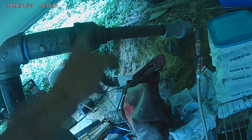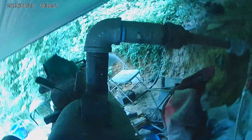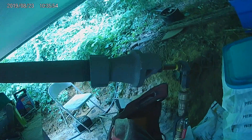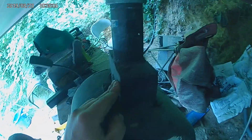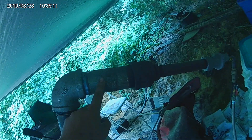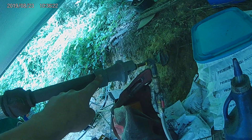This was from a forced air ribbon, which had the straight pipe coming up, the elbow, and then another pipe coming down with the airflow, and the gas inlet on the side. With this, I just have the Venturi at the end. I've seen people do this with just one inch black pipe, but this is what I had and it was already welded up. I didn't want to grind it out and risk destroying it. So I just put the elbow to help mix the fuel, the straight pipe, the two inch to one inch bell reducer, one inch black iron pipe, to an aluminum sand-casted Venturi, which are sold on Amazon. They work pretty well — not perfectly centered, but centered enough to get the job done.